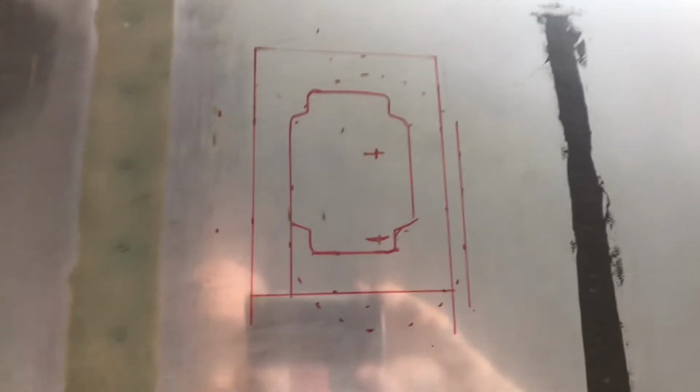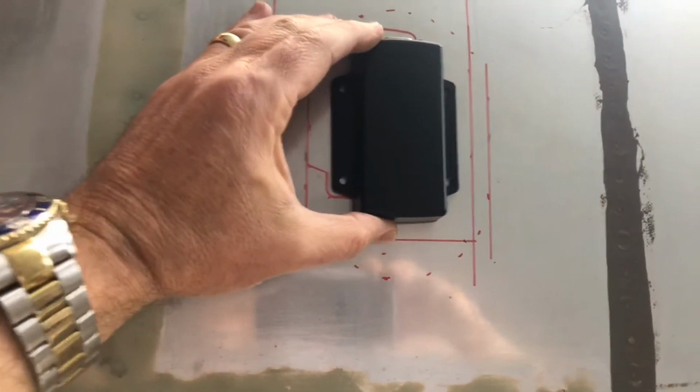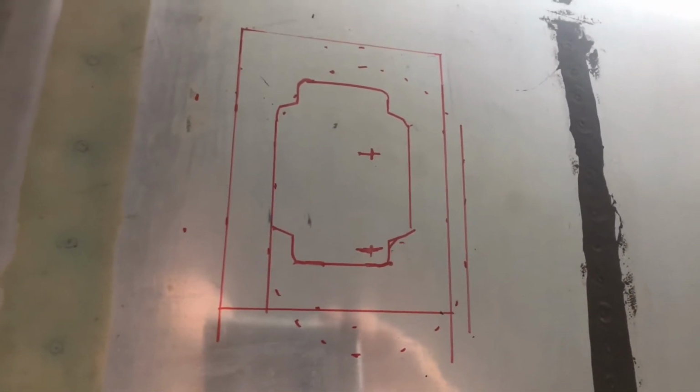Now, I'm sure you might be asking yourself, hey, that's great. How exactly are you going to get inside of that wing to do all this magical work you're talking about doing? So to explain that, that's going to require that I climb underneath the aircraft and show you. So now I'm underneath the wing, and let me show you the next thought. So underneath the wing, I've marked where the magnetometer will fit, and then the size hole I'll need to create so that I can have the doubler and make that work.